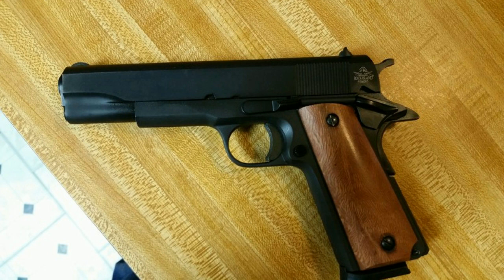Basically it's your plain Jane M1911 A1 with the M1911 flat backstrap installed. One of the differences between the M1911 and the M1911 A1 is that the A1 had an arched backstrap, but a lot of manufacturers go with the flat backstrap. If I was going to build a custom gun using as much of a factory gun as possible, I would probably go with the Rock Island Armory GI model. The only things I'd change are accurizing and reliability treatment, the sights, and the grip safety and hammer — though changing the hammer means you really need to fit a new sear and disconnector too. Everything else would stay stock; I like the original controls.